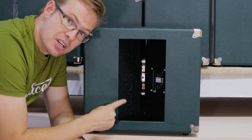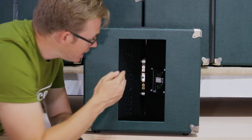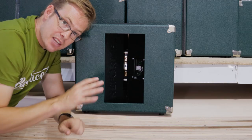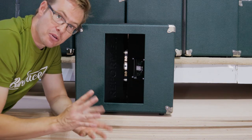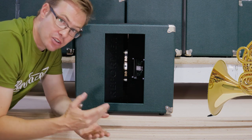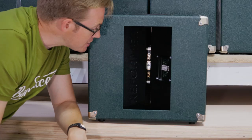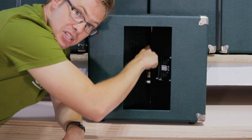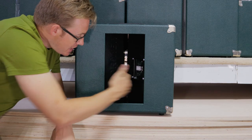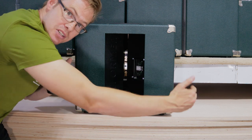But this also, unlike a speaker port, unlike a reflex port, a vent, a resonator — this actually lets the mid and high frequencies come through. That is all sort of at odds with horn theory. So this may look like a horn to you, but it isn't a horn. It doesn't sound like a horn. It doesn't have any horny honkiness going on. It acts as a diffractor which lets these mid and high frequencies through. This then acts as a waveguide to help them spread out around the room sideways.